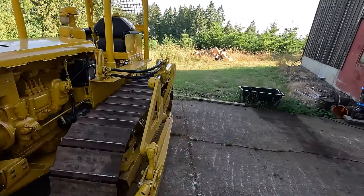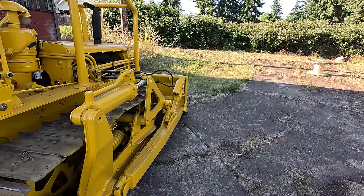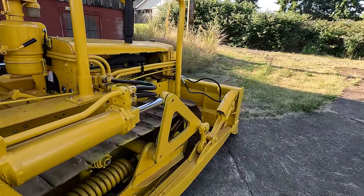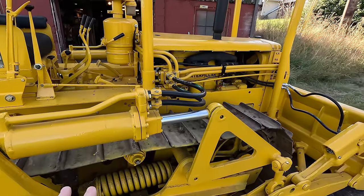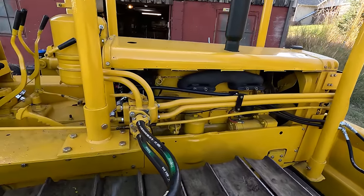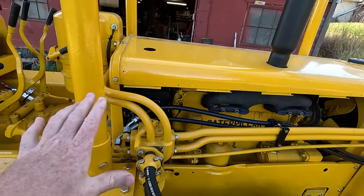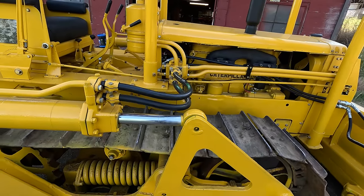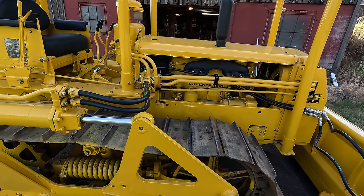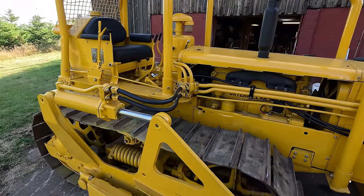The other thing I've noticed is these lift cylinders drift. So neither of these cylinders are leaking externally, but I'm pretty sure it's gonna be a piston seal that's bad. I don't think it's the pump, like the valves in the pump, because I can switch the crossover valve to tilt or lift, and either way, these both drift exactly the same. And I think the way that these are plumbed up, if only one cylinder is bad, they'll both drift. So I'm gonna hold off on that.